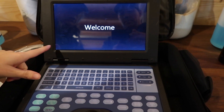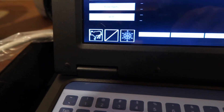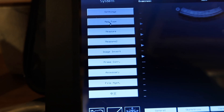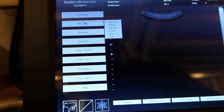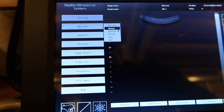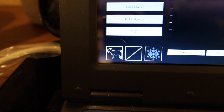We change the setting to goat, sheep, or whatever animal you're working with. Right now it's set for cow — you can see a little drawing of a cow. To change it, you go up to 'App Type,' scroll your cursor over it, hit Set, and it brings up another window where you can change it to whatever you're ultrasounding. In our case we go down to sheep, even though they're goats — it's very similar. Then you hit Set one more time and that locks it in.